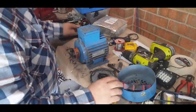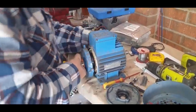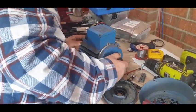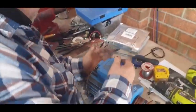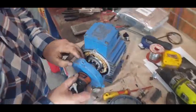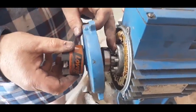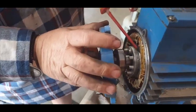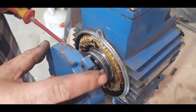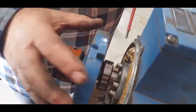We need to get the cover off. The reason it's not coming out is I need to pull my bearing plate off. You can see in there — I need to pull the cover off on the other side. Can you see those little dimples in here? They're used to help hold the weight. See the washer on here? That washer helps balance the shaft. When they cast these, we have the rotor bars which sit up in here — you can see the little rotor bars. We also have the bearing backing plate, and there's a wave washer in here — that wave washer is to help push the plate back so the shaft always has no end movement in it.